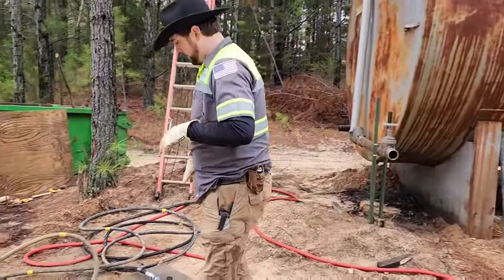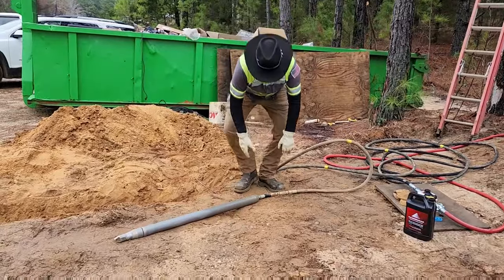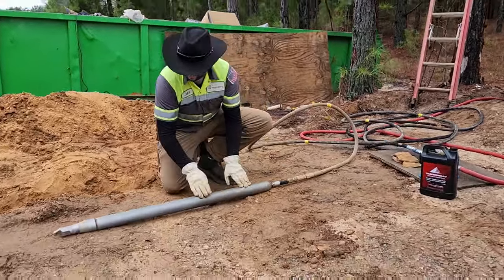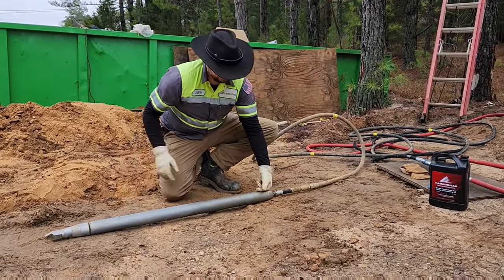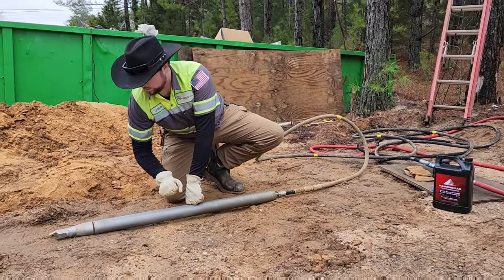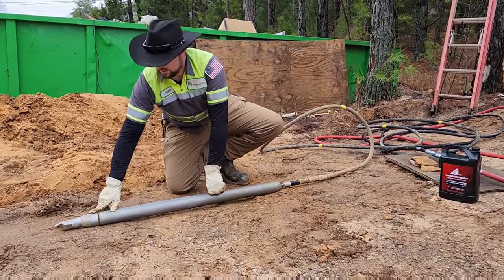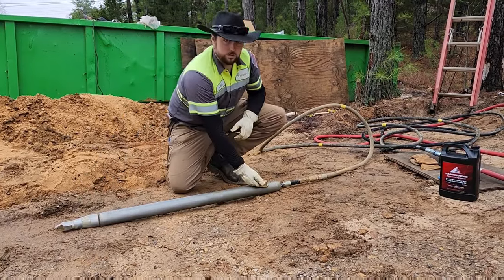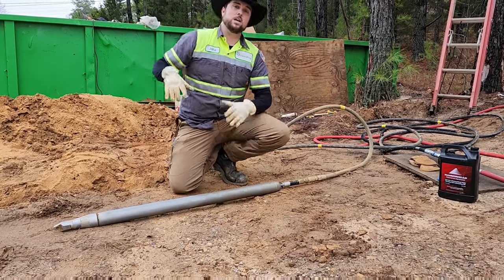As it comes through a small regulator, it's going to oil everything. How this works is there is a weight, this is the stinger, this is the mole, there's a massive weight inside of this, and this is a big ram. So as air comes in this end, it shoves this weight against the tip of this head and forces it to go in just a little bit, just barely pierce the dirt. Then as it goes back past, it passes a couple ports, which shoves it back the other direction. And it starts this reciprocating action, going tut, tut, tut, the whole time.